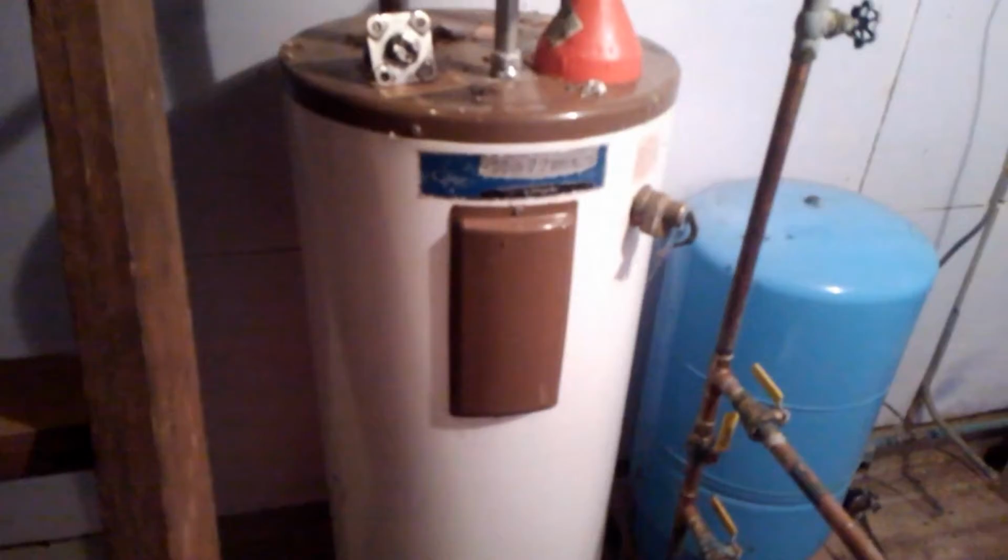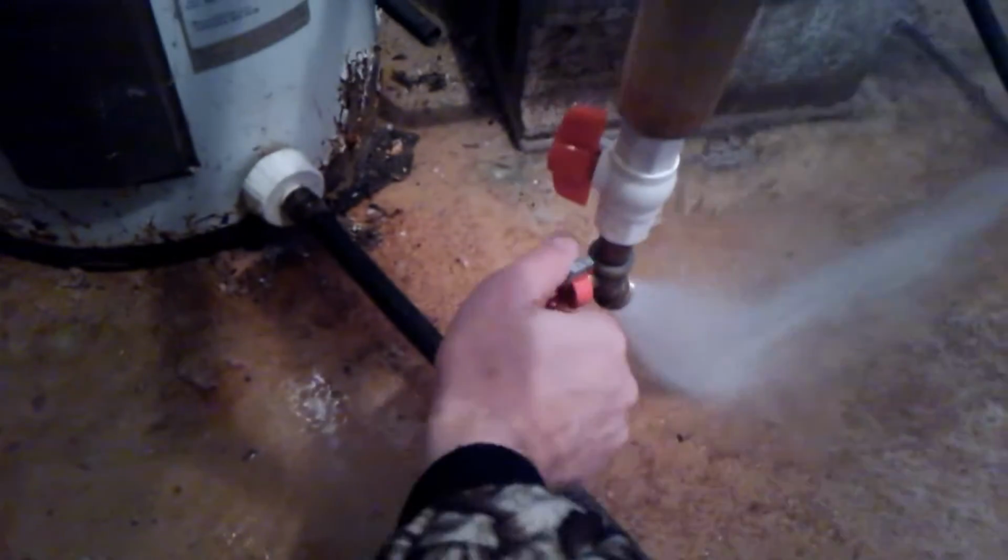And when they do, you go down into the basement here, and just these two boards in the front pop out. I put a screwdriver in and pry it up, and those come right up. Then you're going to go in the basement, because the idea is to get all the pressurized water out of the lines. They don't have to be totally waterless, but you want to get the pressurized water out. So once those upstairs are done, then you turn off these and let those drain, and they'll run into the sump.